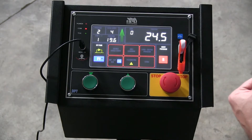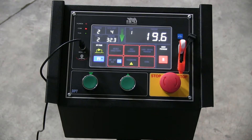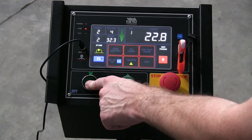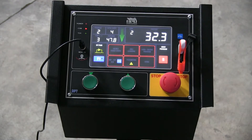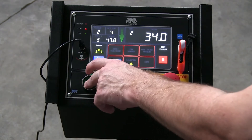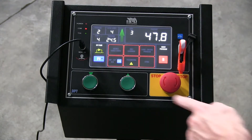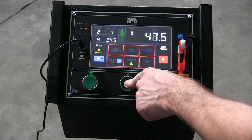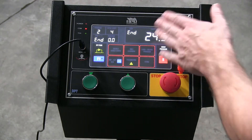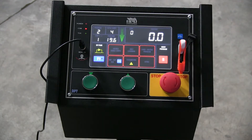It immediately wants me to start from step one. Step one's position is 19.6 — I want to go up to 19.6 and roll the part through. Now it wants me to go down to 32.3. Imagine rolling your part back and forth, bending a little at a time, with some work hardening on the material. On step four I programmed it to go back up, so the arrow is pointing up. As you go through this your steps change, and when the program's over it will say end, then you move back to the top and it restarts.